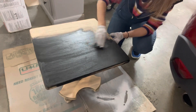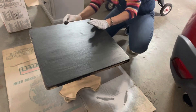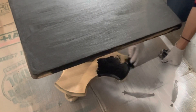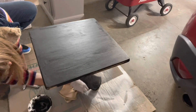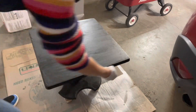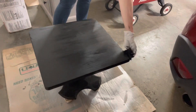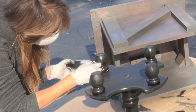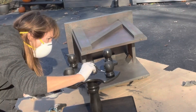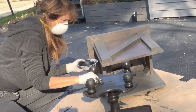It is very important when staining a piece of furniture to make sure you remove the varnish or polyurethane coating so the stain will adhere. I'm not trying to see the grain but rather to give it a nice even coating of black, making sure to get the edges. I've now flipped the piece over to catch any spots I missed, and in the crevices where the feet are I'm using a paintbrush to get into all those spots.